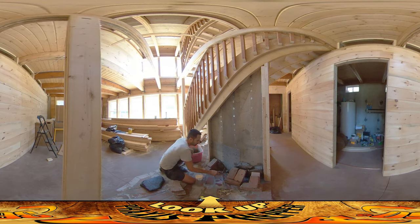What I want to do is take my trowel — this triangle-shaped thing — and push the concrete up into the wire lath here. I want to push it through so that it creates little fingers going through the lath that will grab on the other side. I've got plastic behind here so the concrete goes through, hits the plastic, and then deforms on the other side, ideally grabbing onto itself.